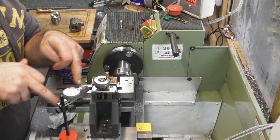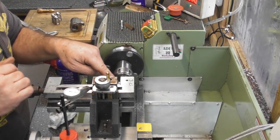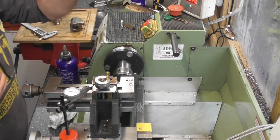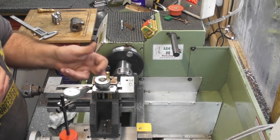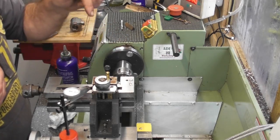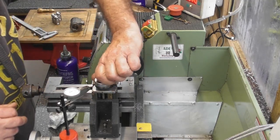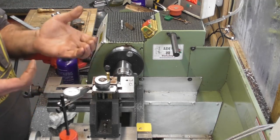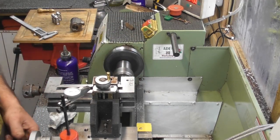I've set a DTI up on a little magnetic stand on my milling slide. The slot has turned out at 4.8mm, and after re-measuring the original slot two or three times, it's 4.9mm. So I'm going to drop down by 0.05mm, machine a bit off the top face, then come up by 0.1mm — or 0.05mm up and down from centre — and machine the bottom off. I do have backlash in this milling slide, so I'll go down beyond my 0.05mm and then come back up to remove the backlash. The weight of everything on this slide is normally pulling down, so that keeps backlash loaded.